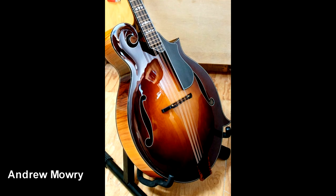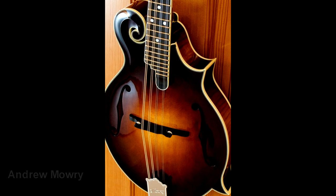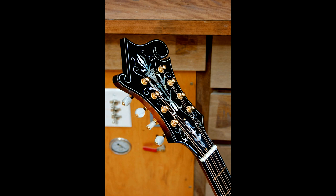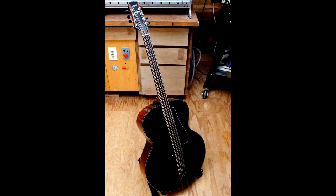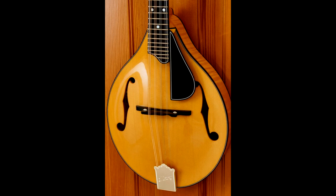The original version of Royal Lac could even be French polished, and I've done that with great results. Unlike other catalyzed type finishes, it has a pot life of nearly 10 hours, so there's no risk of your gun becoming a brick before you can get it out of the gun. It looks like shellac, but it has the durability of polyester or lacquer. It also has excellent chemical resistance after curing, and it's available in a quart size as well.